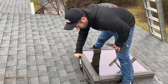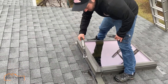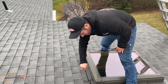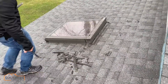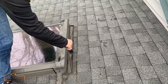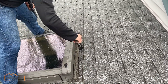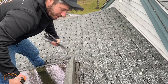Every time it rains, it takes a little bit for the water to build up, but then it's going to be working its way back up the shingle because this is a low pitch, or it's going to be catching the caulking and running further left and right. All you need is a little channel up here for water to flow the shingle down this way. When we cut these shingles, you wouldn't believe how much water flowed left and right. Now when the water comes down, it's not going to build up and try to find a way — it's going to hit the pan and flow left and right. This is where your shingle should be; that's why this pan here comes all the way up here. This is where you're protected. It needs to be able to flow left and right.